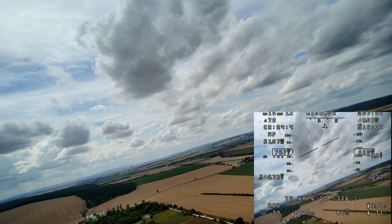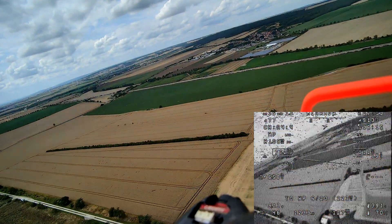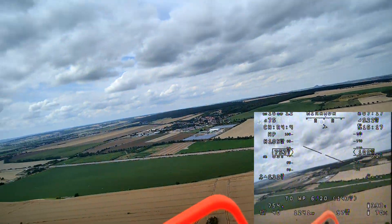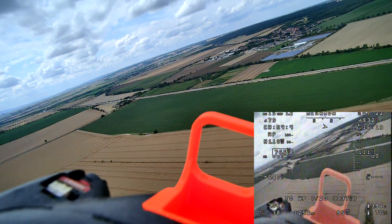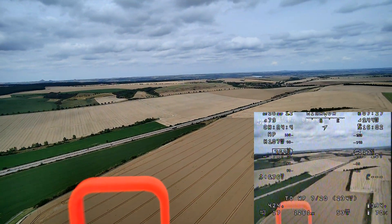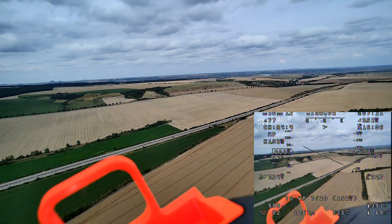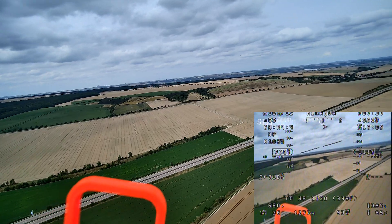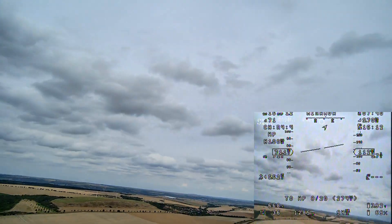So I quickly passed it, and with FPV mode only on pitch control it was hard to point the camera at the other airplane. So I switched to the follow mode a little bit later. And here you can see the problem with the crooked horizon again — the gimbal has horizon drift. If I do a long turn as I did before that video clip, the accelerometer will get false readings relative to the gravity vector, and this causes the same kind of horizon drift as we had in the past with INAV.